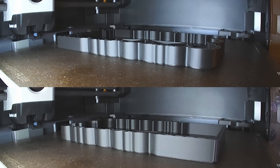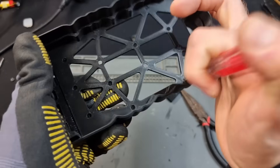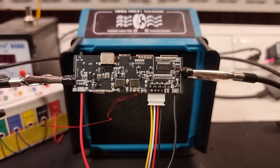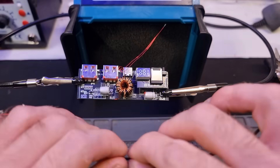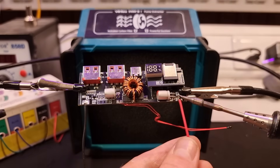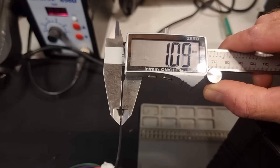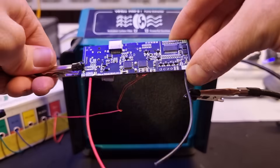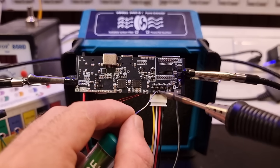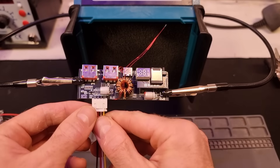In preparation for the final assembly I'm going to print off both sides of the enclosure. Time to get the USB board prepared — there are about six wires that need to be added. I cut a 5cm black wire for the negative and a 5cm wire for the positive and solder these onto the positive and negative pads of the board as the main power wires. I use at least 18 gauge wire for these because the USB board can draw around 5 amps. Then I also add four extra wires which allow the board's built-in battery management system to monitor the voltages of each row. I'm using a JST connector to make wiring easier, but directly soldering the wires is fine too.